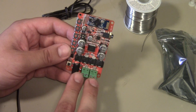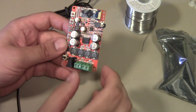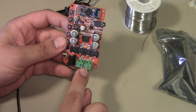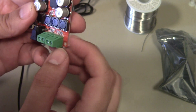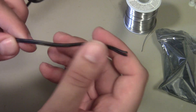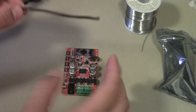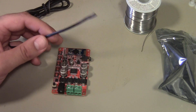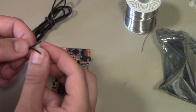If I was wiring this up as a dual speaker setup, you're probably going to want to care about which connector is your right negative, right positive, left negative, and left positive, which is silk screened on the board. Left positive is this one, and left negative is this one. Typically on your speaker wire, one of the two sides will have a white stripe or ribbing on it — that's typically your positive side. But since I'm only wiring one speaker, the polarity doesn't really matter, because I'm not trying to match polarity between two separate speakers. If you mismatch the polarity, your two speakers will be fighting each other, but since I only have one speaker, it doesn't really matter.